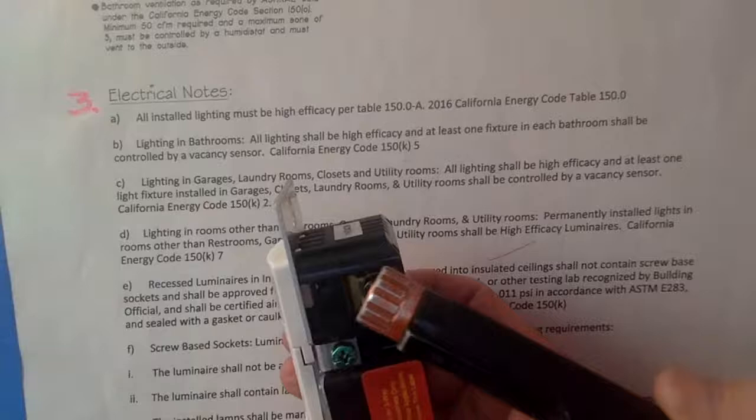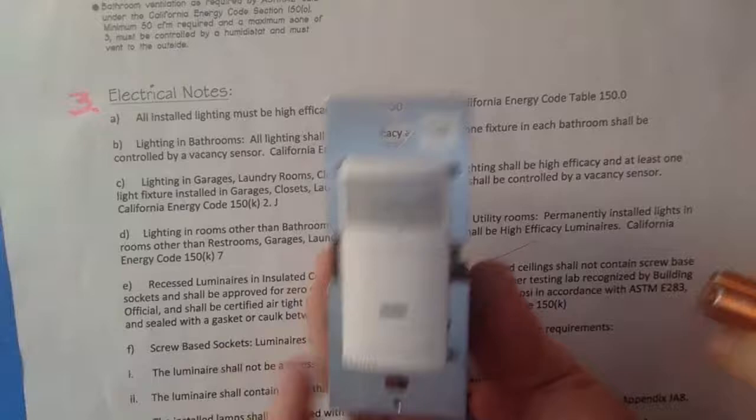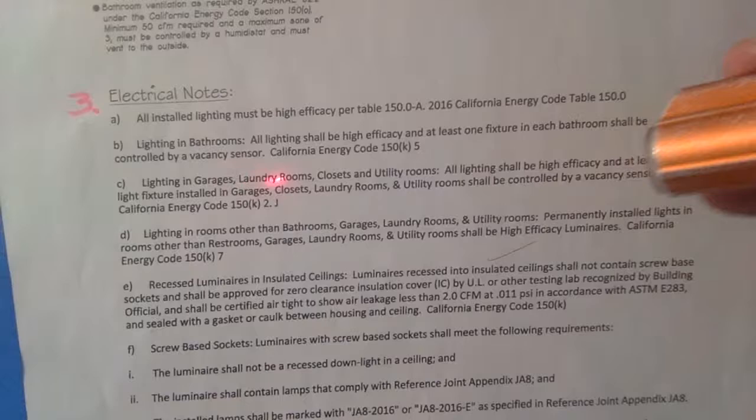There's also more wiring — you have your hot and your ground, but there's also a switch leg and a neutral. There's no running two-wire switches for these; you need a neutral. You should be wiring switches with neutrals anyway, in my opinion. If you're trying to go cheap, this is something you absolutely need to put in, or else you will not pass inspection.